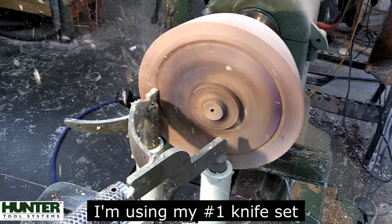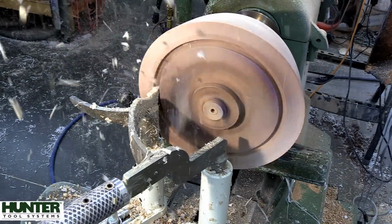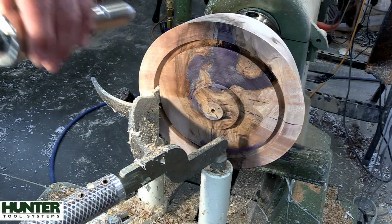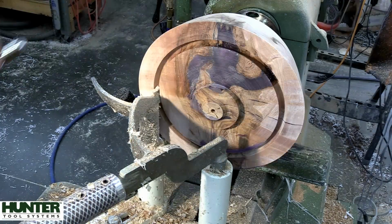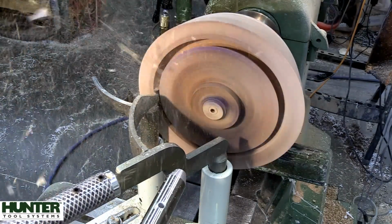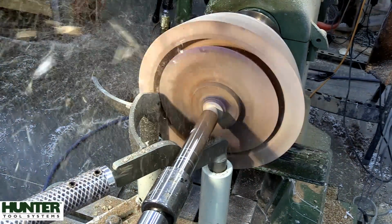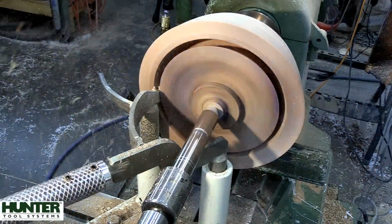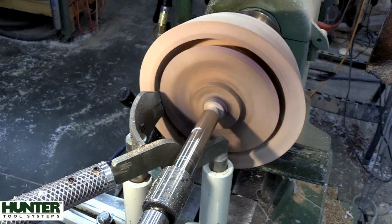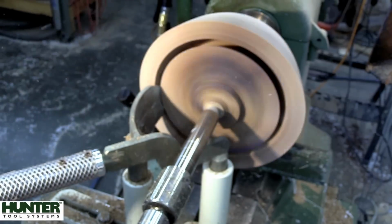Now, I could have gotten possibly a larger core to this, but I do plan on moving this outboard, so I knew that I was gonna have to chew it up again. There, I'm seeing if I can get any tailstock support. Couldn't do it. You'll see right here, I was able to get this tailstock support in, and a little extender from John Tully again. Thank you so much for that, John. Worked great. And the plan is to move this outboard so that I can finish it.